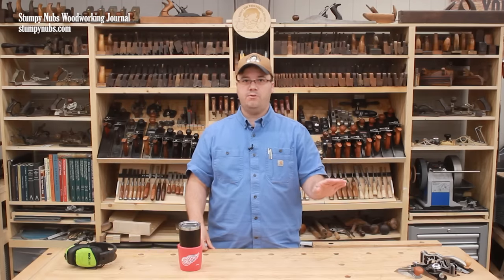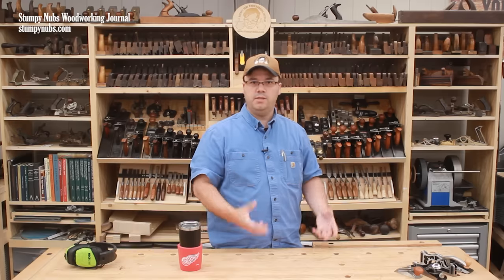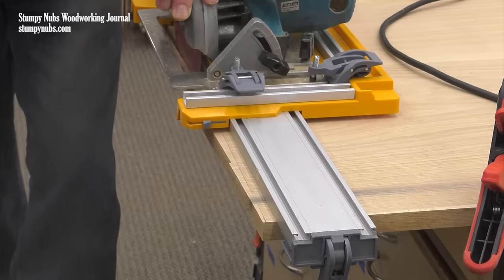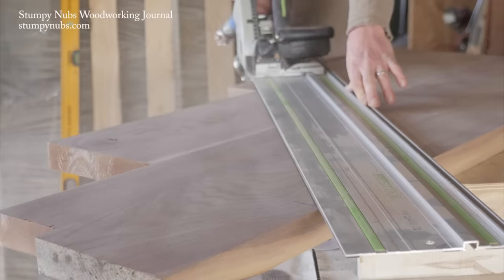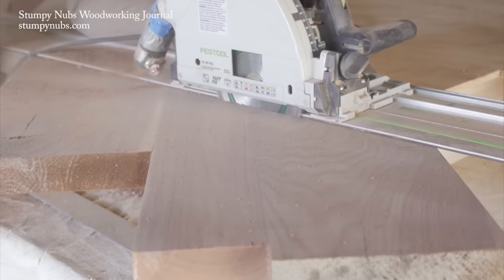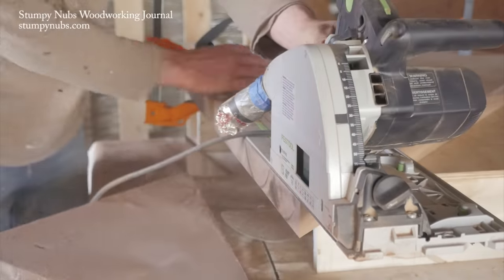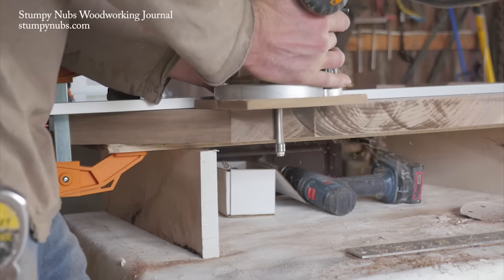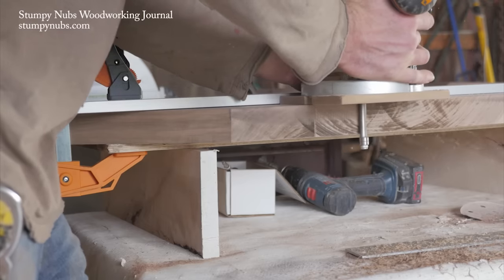Before we discuss the joinery we should discuss cutting the joints. This can be an intimidating process because the slabs are very likely large and unwieldy and the last thing you want are gaps in your joint. We cut one with the track saw and the other with a circular saw and edge guide. The track saw was a little bit easier especially for the angled cut but both did the job. It's important to make the entire cut in a single fluid motion — do not pause mid cut or you're likely to leave a blade mark that might appear as a gap in the finished joint. If you aren't able to get a perfect tight seam, consider cleaning it up with a router and a straight edge, just skimming the end grain with a straight bit to clean up any blade marks.